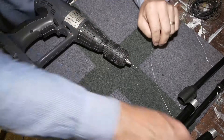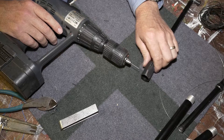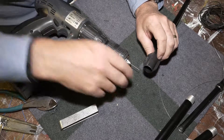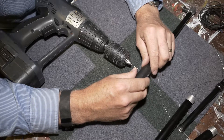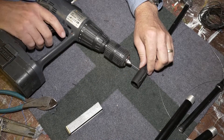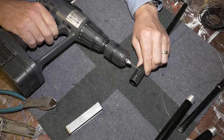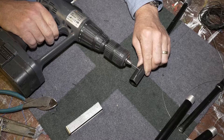To drill the plastic nut, it's easier to have the drill still and hold the nut because it's nice and light. It's so easy to break these drill bits, and they also need to turn fast because they're very small. It's important that we drill where the nut is going to be pressurised, so that's going to be here. I'll drill here and again, and just keep drilling right next to each hole.